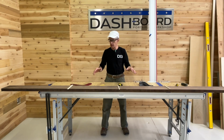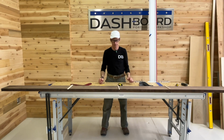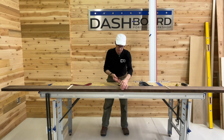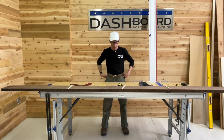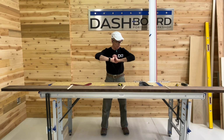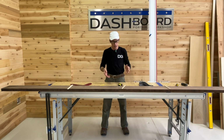This is the one where I made the mistake when I was cutting it apart originally. So the center section is meant to be this long, and then the end sections are equal but shorter. So I made a mistake and I cut it right in the center. So I need to put these 2 pieces back together, and I know I'm going to lose a little bit of continuity in the grain, but that's going to happen on all these joints anyway. It's not going to be very noticeable, just because none of these was straight when I cut them apart, because they're just rough sawn edges, and they'll have to be squared up anyway, but it's not too bad.